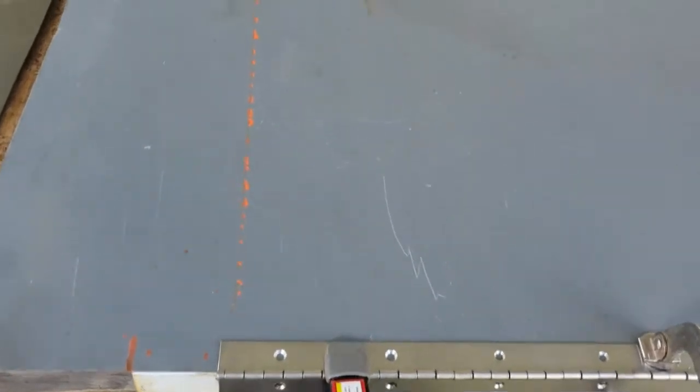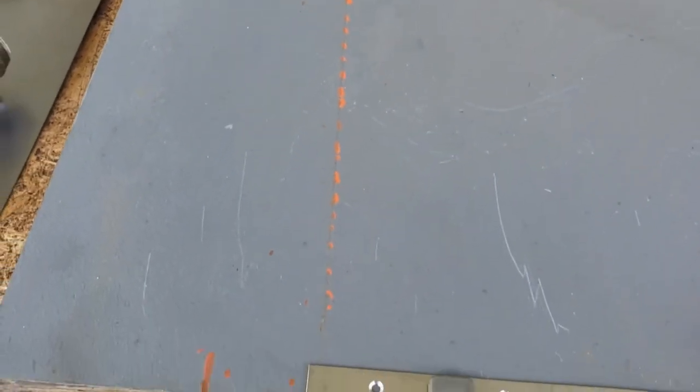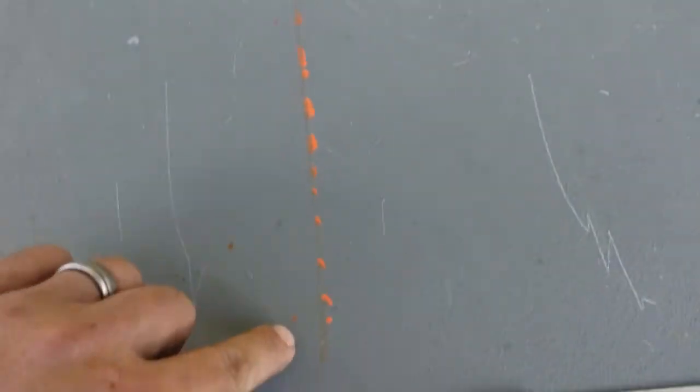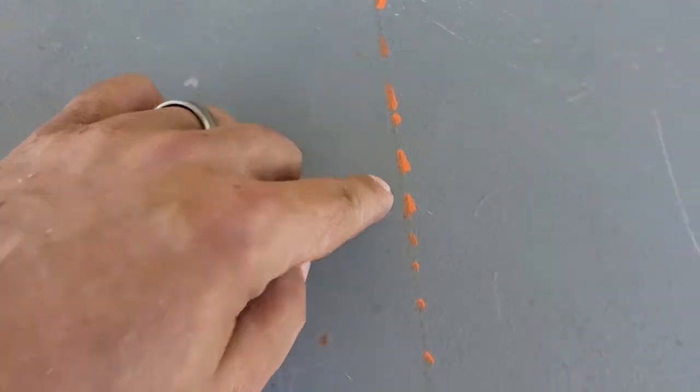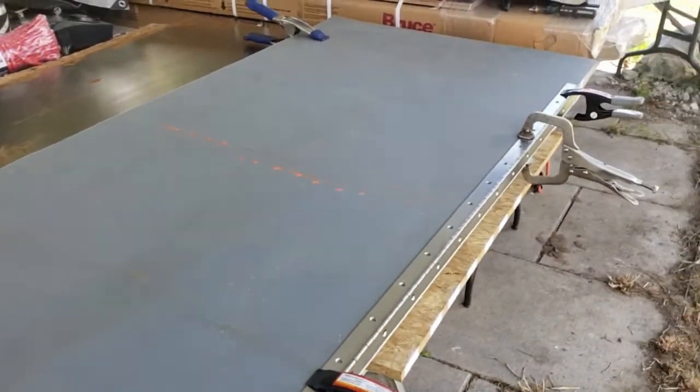The very visible markings here are the edge of the bar. It's the support on the inside. That's where the rivets are going to go. I've got faint lines where I'm going to drill the holes, or faint marks, and then I'm going to drill for each of these for a rivet hole. So I've got everything clamped. I'm going to drill the holes.